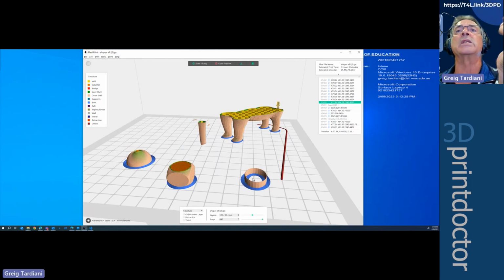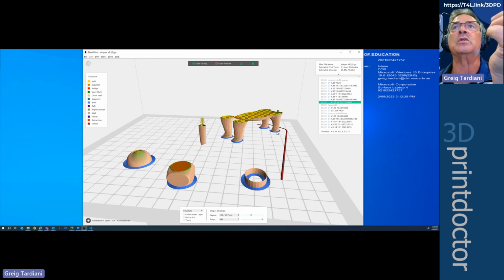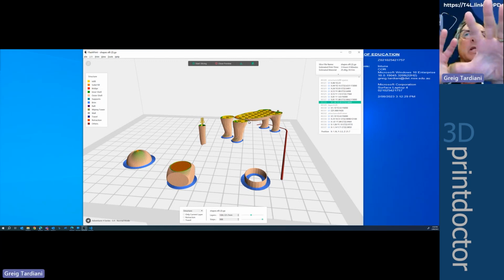So I would say what's ended up happening is that we've got to this point, and without a brim or a raft, you've ended up with a few little issues, and it's broken away at times. There can be some weird issues with some prints that have faults within the STL that simply get to a point and then the print head moves. There are some issues with the actual STL.